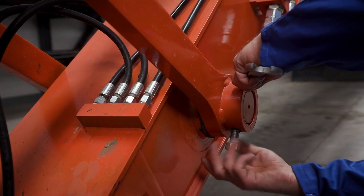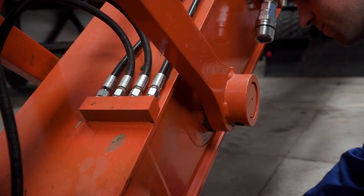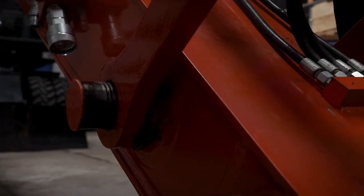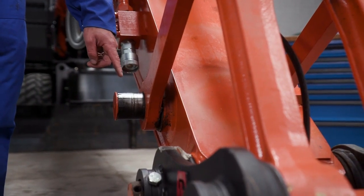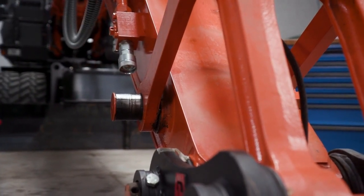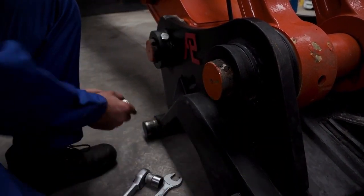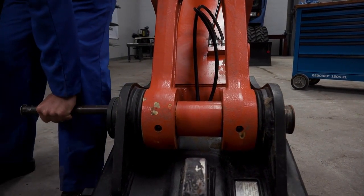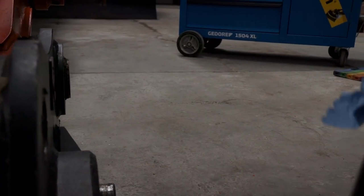The installer begins preparing the machine by removing any pins that could become damaged during the lube point drilling process. This is not always necessary if you are simply attaching the lubrication dispense hose to the lube point directly. This practice is common where there are areas that damage to the lubrication system could be a concern, and the location of the lubrication point needs to be moved. This will increase the life of the lubrication equipment.